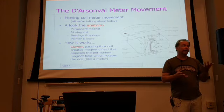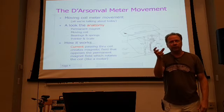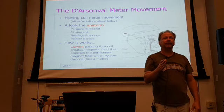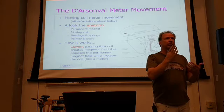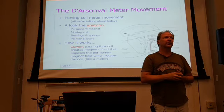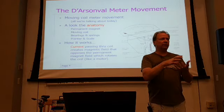It is hard to tell. And you have to remember, even if a meter says it's rated for 100 or 200 microamp full scale, they're not going to be exact, which is why there's always a little bit of trimming involved. They're never exactly 200 microamps. So you've got two springs. Don't they have to be balanced? Well, there is a couple of measures of balance.